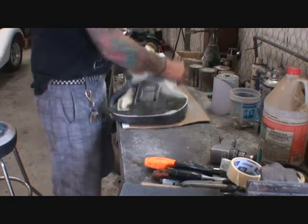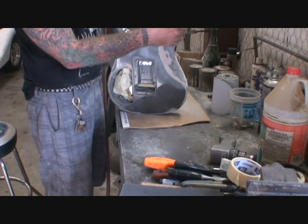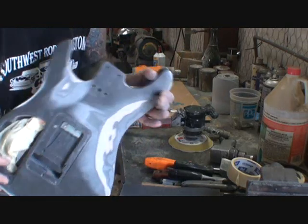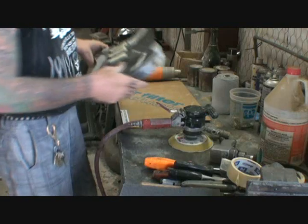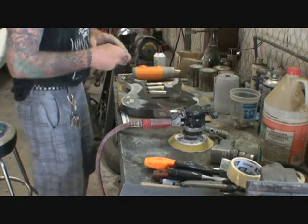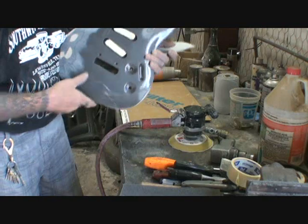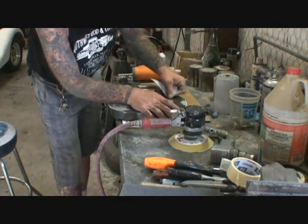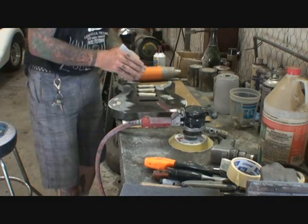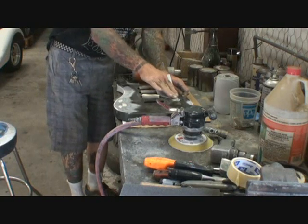We're doing a little bit more than we usually do to start out with. Yes, it does look like it's sanded — like I said, just bear with me. Now we're going to do a little bit of sanding by hand. He's got a concave area where the switch is going, and there's no cover there. So we're gonna take our 80 grit one more time, just hit that edge. Don't worry, believe me it's going to look like an old guitar when we're done. On this edge here you just want to sand it to where you see the wood — that's it. This is probably poplar wood.